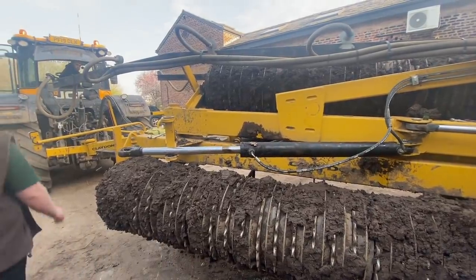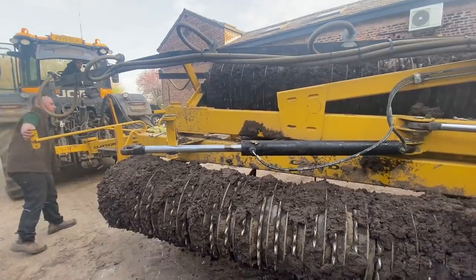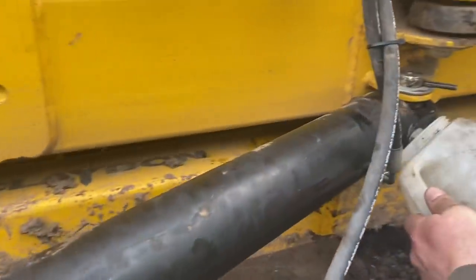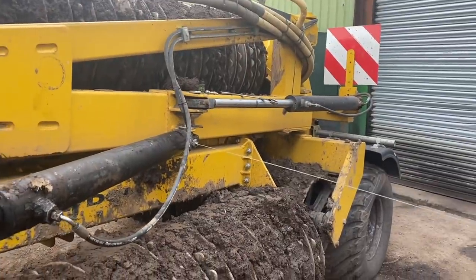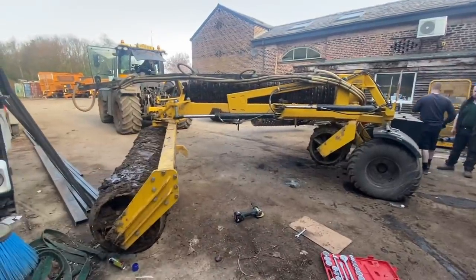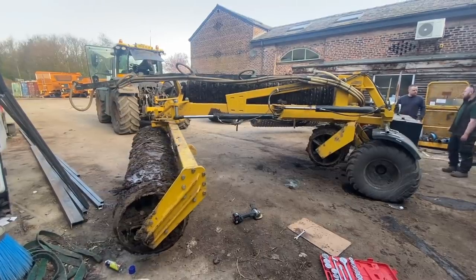It went out but it didn't want to go back in. Messing with the rollers, we realised why — it has a sequencing valve and we had to let some oil out of the ram. I tried to catch it in a jug but it wasn't very successful because it came out like a shotgun. All back together now, seems to be working.